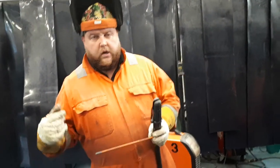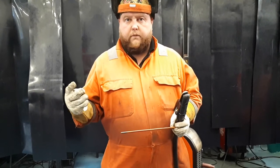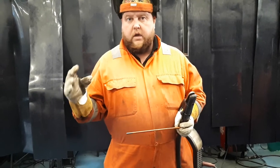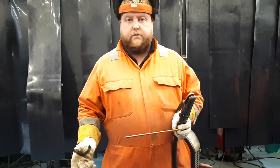It is very noisy, so if you're doing a lot of air arc gouging, ear defenders are a really important thing. It's also a form of arc gouging, so the UV, infrared, and visual light given off is very high — you're looking at roughly a shade 12 to 13 when you're gouging. It's very important to look after your eyes.